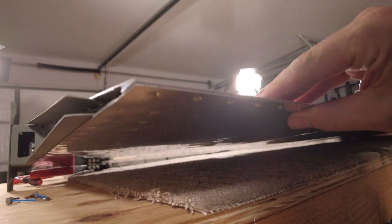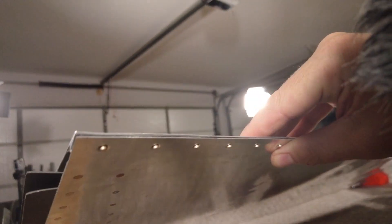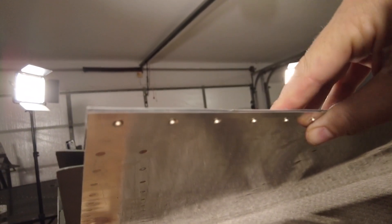These springs are set to align the edges just perfectly, and as we were told from Mike at Cleveland Tools: go through with your traditional pneumatic squeezer and set it like half set — so they're not going to move. You look at it and it's definitely under-set, then you come back with these and use them pretty much like regular squeeze sets — you put them in.